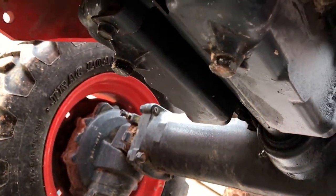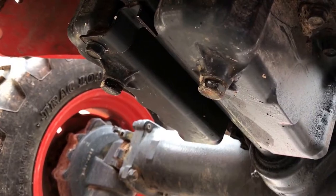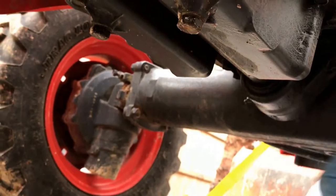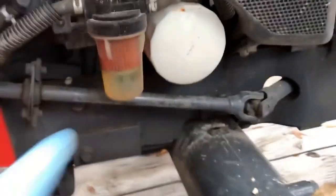Some people maybe have missed this and wouldn't pull both. You've absolutely got to pull both or else you're not going to get a full oil change. So pull both. My drain pan should fit under both, so I'll pull both and let it drain out. And while it's draining out, I'll take my filter off.